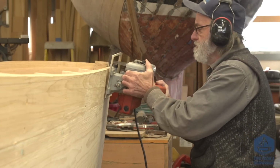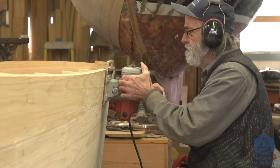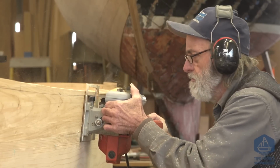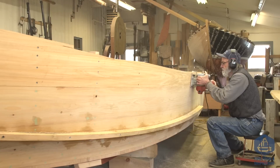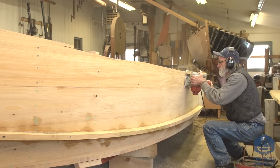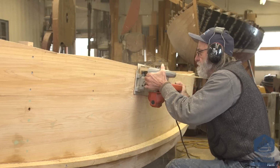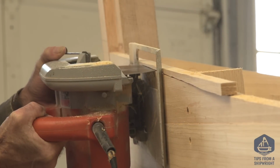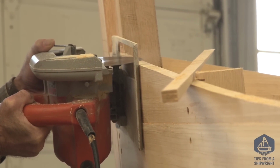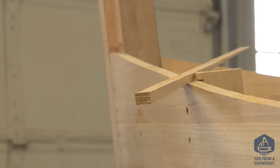Well, we're back from New York with the pieces that we cut out of the woods that we're hoping to use for a breast hook, and that's what this video is really going to be about. But before we get involved with that, I'm going to recut the shear here a little bit, because after we put the lift rails on and looked at the boat all over again, we already had the guards clamped up there, and it was one opportunity to adjust it, and we just lowered it because we couldn't raise it anywhere. So we pushed it down amidships a little bit more and redrew another line on it, and we're cutting that line with the skill saw again, just taxiing along on our little rolling stool here, and it's working pretty good for us. We cut into the frame heads a little bit, but that doesn't matter because we're going to cut all the frame heads off anyhow a little bit later on.